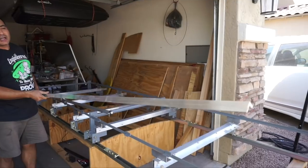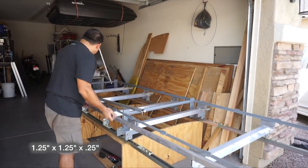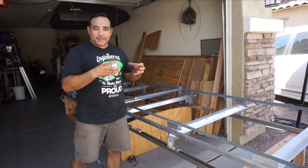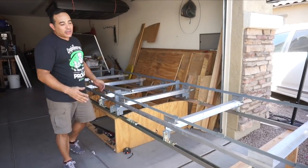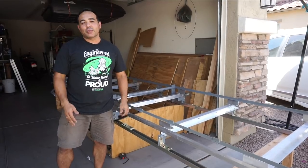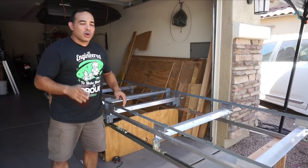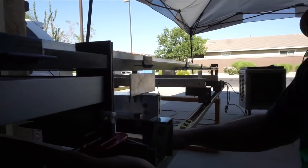So what we came up with is to try a larger piece of aluminum angle. This one is substantially larger — one inch by one quarter — and we've made it long enough to fit across all of the sliders. So instead of depending on the panel to keep things secure and only pushing the inner four sliders, we're now pushing on all six sliders. We're hoping that combined with the bigger, sturdier piece of aluminum reaching the entire way across, it will eliminate that sway that happened at the end. That's what we'll be testing today.